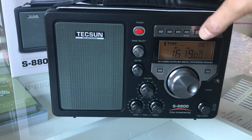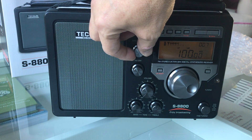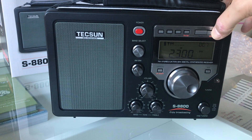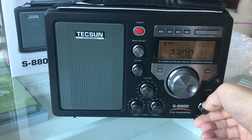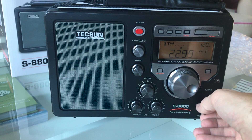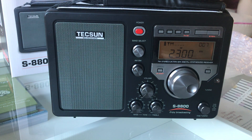You can set this thing to lower sideband or upper sideband. What's interesting is that when tuning in sideband mode, the radio tunes to within 10 Hz, which is nice. In standard AM mode the resolution is 1 kHz. For a DXer on the tropical bands that's a quite useful function, because quite often those stations don't always broadcast on exact multiples of 1 kHz — they're quite often off frequency. So that fine tuning in SSB mode is really handy.